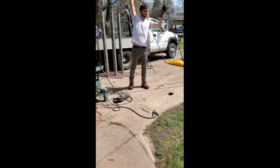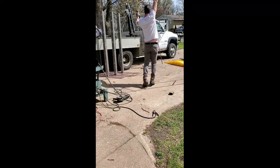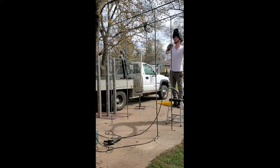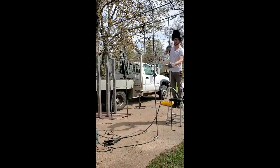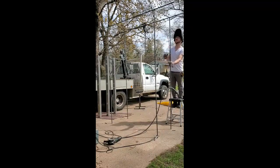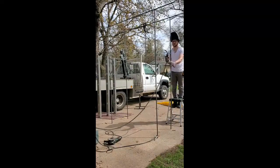But that is the beauty of ornamental ironwork. To this rectangular frame, I can now add curves, swirls, baskets, finials, and scrolls, and I can add them in a way that simultaneously increases the beauty and structure of my archway. In fact, the very first thing I added was a curved arch. This not only provided aesthetic relief from the right angles of the frame, but also was a gusset for the corners. And as I added more layers, the frame continued to stiffen up.